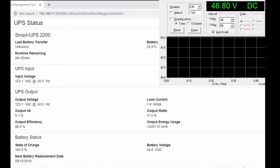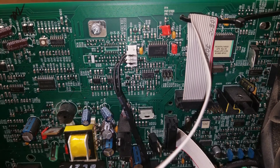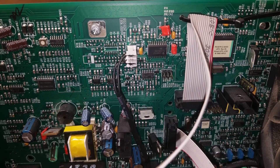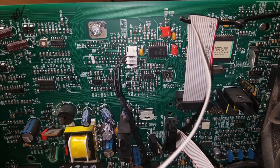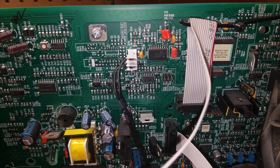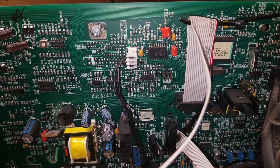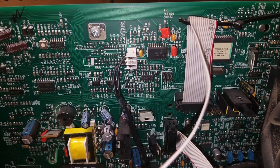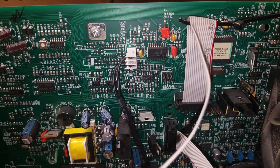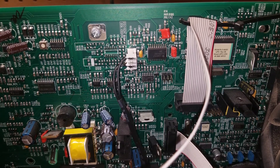Next step, we'll take the cover off and proceed with the fix. I've disconnected the unit from utility power, disconnected the battery, and removed the top cover. On the mainboard of the UPS, we see connector J606. This connector allows us access to the smart protocol which can be used to reprogram the UPS. In older models this was accessible with a serial port on the back, but now is only accessible from the connector internally. To interface with this connector, we need to use a TTL serial to USB adapter. The connections are from the top left pin to transmit, the top middle pin to receive, and the bottom middle pin to the ground of our serial adapter.